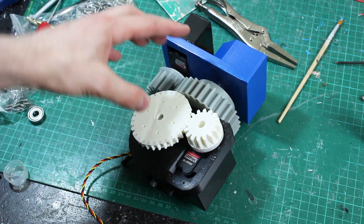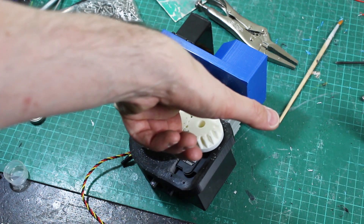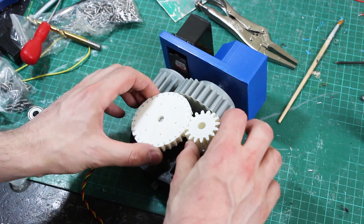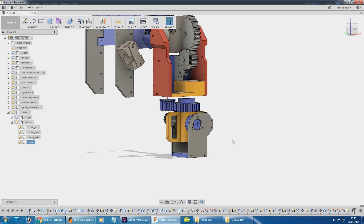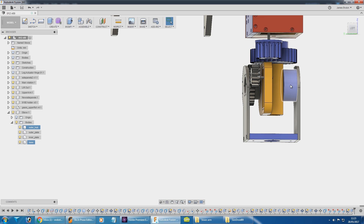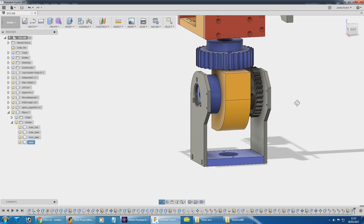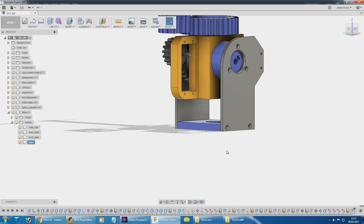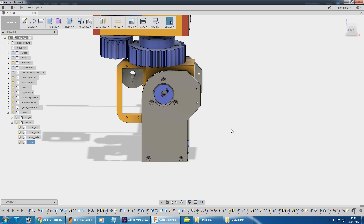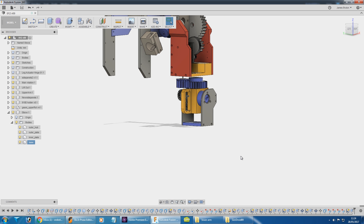That's mounted on a bearing either side with the big gear, and the servo is the small gear - it runs pretty smoothly. Mounted on there is the final stage: the elbow. This piece turns as before, and we've got gears from another servo to make the elbow move. We've got a 180-degree servo geared down to 90, but if the elbow starts not quite straight it'll be able to move up past 90 degrees bent, which should be okay. The gears mesh really well with hardly any backlash. I need to make a lower arm, but for now just a stump attached to both sides, with a hub on the studding with a grub screw coupled to the driven gear.